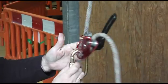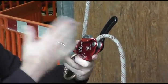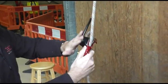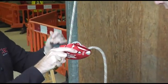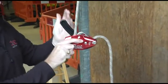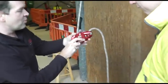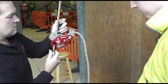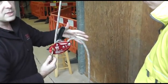The main things that make this different from other descenders are the operation and the materials. The handle is aluminium — no plastic — and it rotates all the way around. You've got a working position which allows you to descend, and if you let go, it automatically stops.